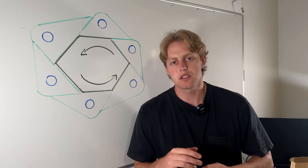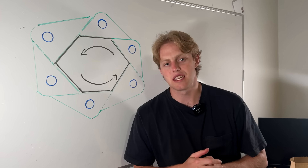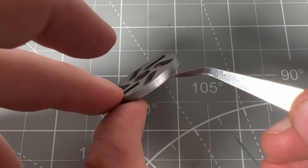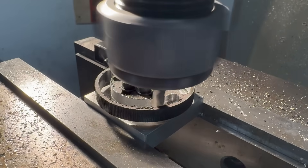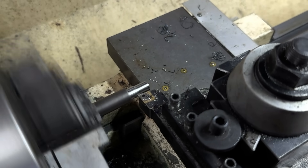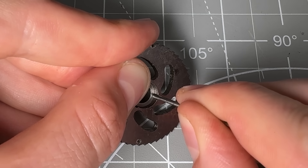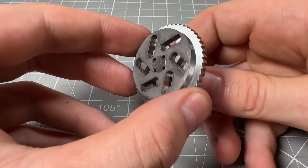Back when I started, I thought I'd just throw together a prototype, stick a label on it, and sell a million of them. It turns out it's really not that easy. Getting this wrench made required tons of hard-to-make small metal parts. I started by having all flat parts laser cut to save some time, but these laser-cut surfaces were not nearly precise enough, which meant all critical surfaces still needed to be machined. Next was the center bushing — I turned the contact surfaces on the lathe, then milled the precise slots to lock them into the plates. These slots had to be lined up perfectly; if they didn't, the whole wrench would bind. And if the bushing fit wasn't just right, the whole assembly would just fall apart.